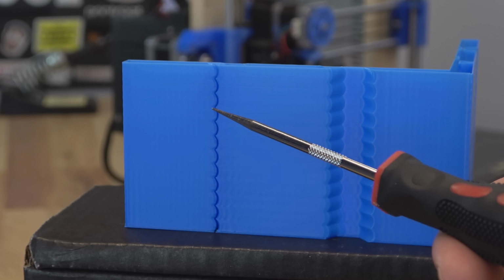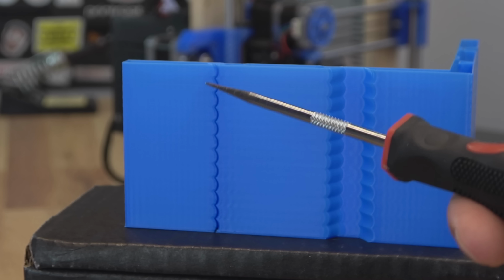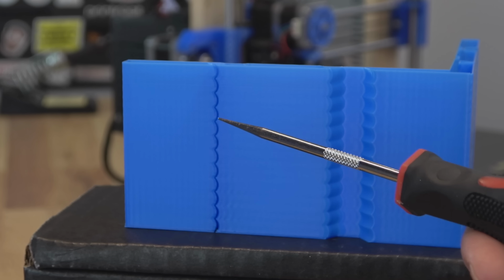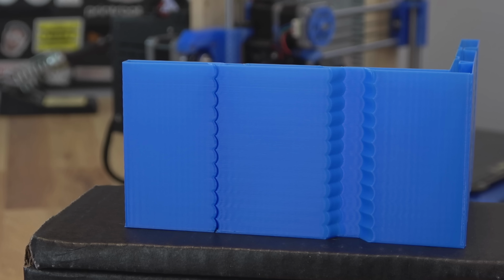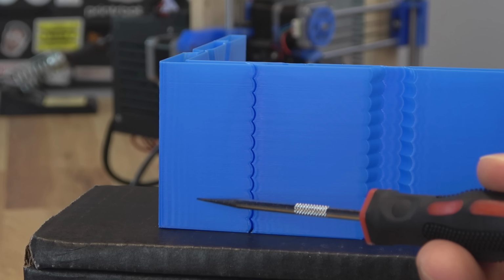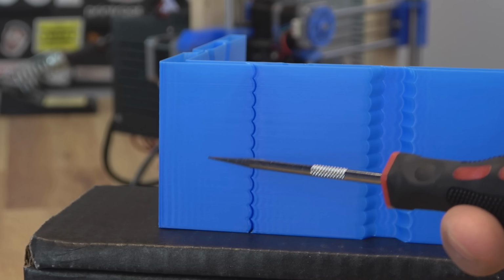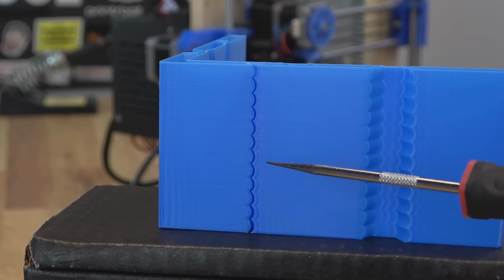This is going to give you an idea of input shaping if it's actually too much. You don't want to see gaps in the part. It has to be relatively close. So we don't want to overdo it either. But this is X, and here's Y. So again, roughly the same range. You can take a look at the corner over here. That's a good indication. Right around here, it starts to smooth out. So those are the areas that we want to focus on.